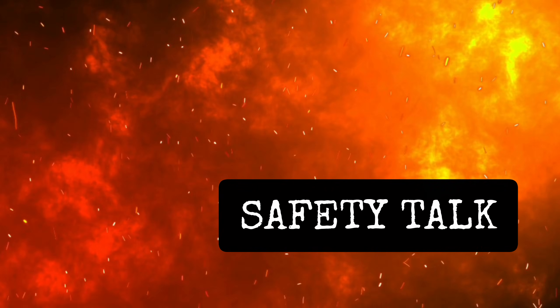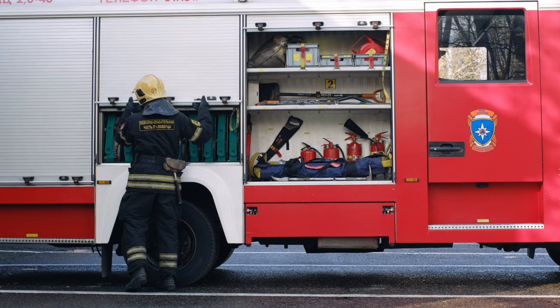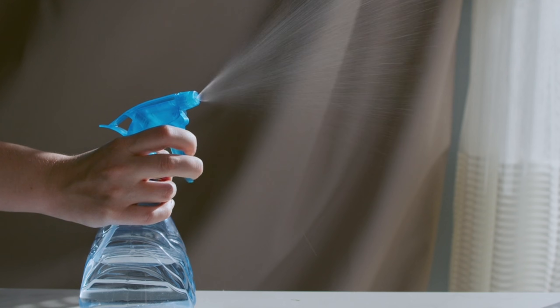The boring but deadly safety talk. Don't look at the laser beam — it will melt your eyeballs. And don't touch it either — it will melt your skin off. You might have gotten some cool glasses with your laser, but they might not be that good. Search up some nice certified laser light-blocking brands, or do what I do and just don't watch the laser beam when you're cutting stuff out. However, never ever leave the laser unattended. Keep a fire extinguisher or at least a spray bottle of water nearby. I'm convinced everybody who has had a laser for a while has some sort of fire story, so seriously, stay close. Nice lasers have a fire detection function, but not all of them, and they're not 100% reliable anyway.